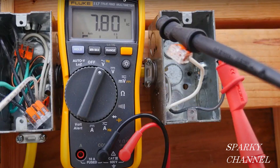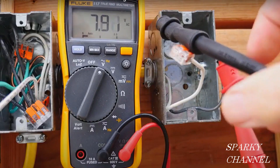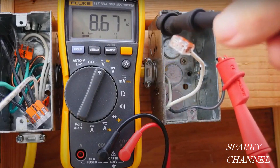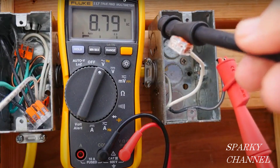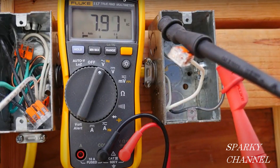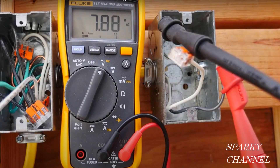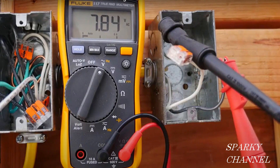This is a good test to do because sometimes in old houses there will be a ground wire going to the back of the metal boxes, particularly in kitchen and bathroom circuits. If you do this test you will get close to 120 volts — if you have your red lead on the hot wire and your other lead on the metal box, you will get close to 120 volts, and it will be grounded because the back of the box has a ground wire running to it. However, in old houses these wires are 16 or 18 gauge, so they are not sufficient for today's code.